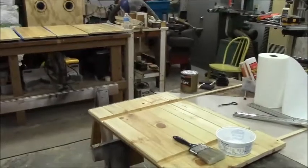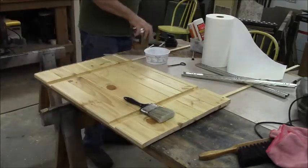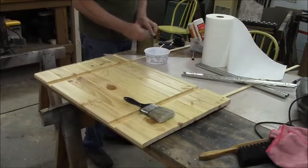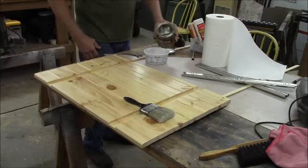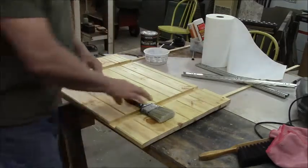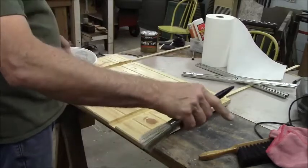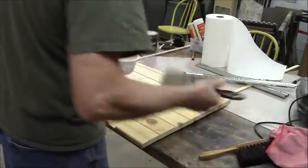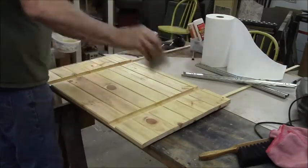Putting the final finish on. Clean bowl, clean brush — I took them in last night, cleaned them with paint thinner, and washed them with Dawn and hot water. I think I'm going to use up about a quart for this — there's about a third left. The more coats you do, the less it sinks in. I've already done the sanding with the Norton 5X sanding pads — about three and a half by four and a half, 220 grit. They've been brushed with a foxtail and then tack cloth.